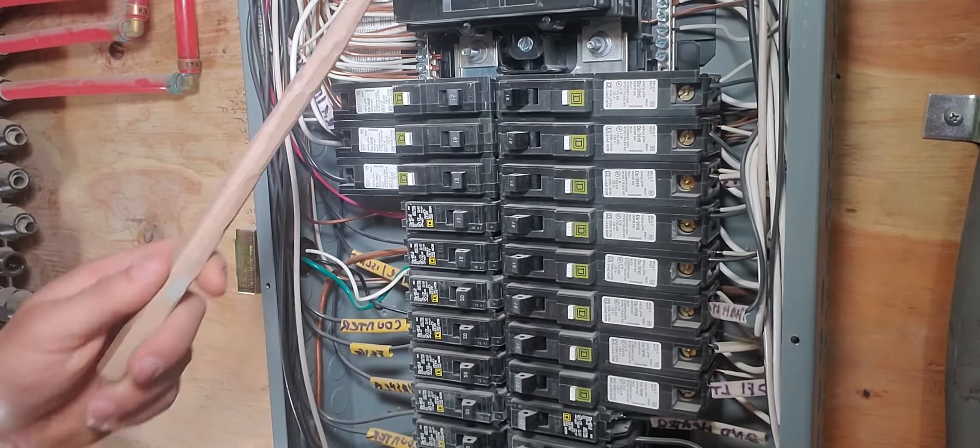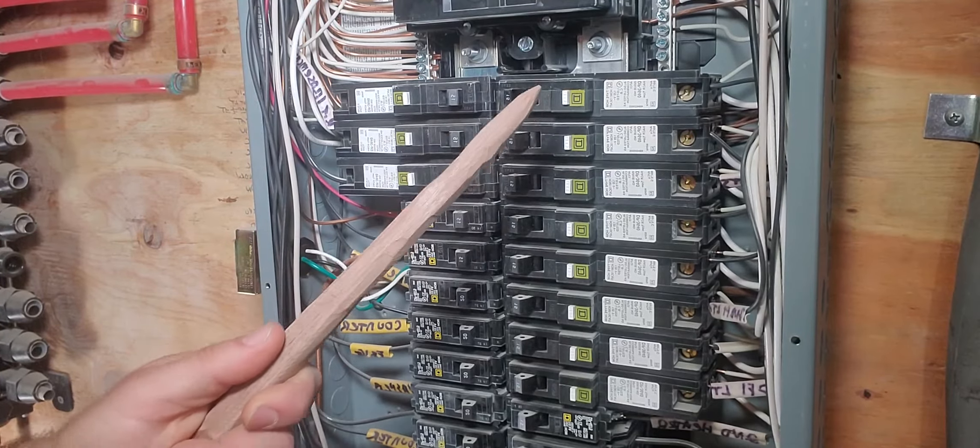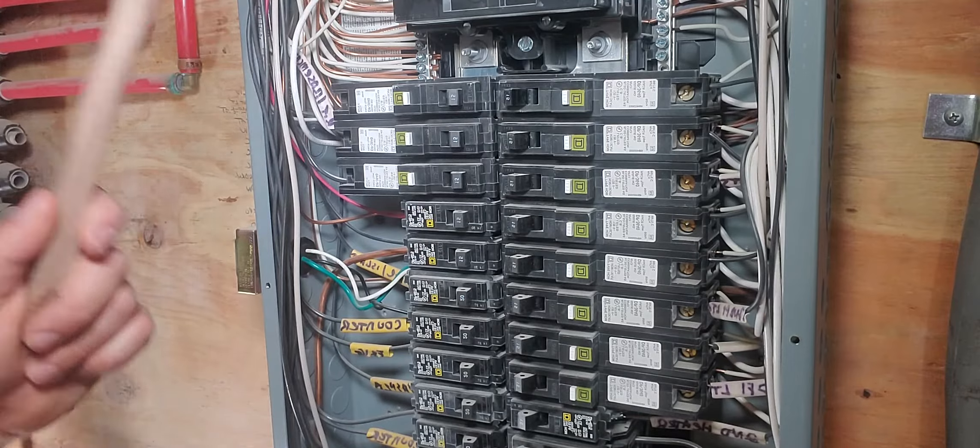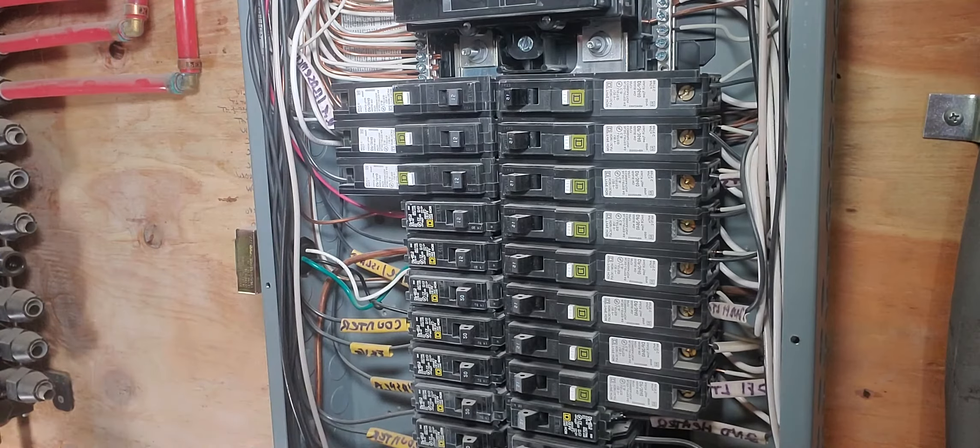The smaller breakers below the main also have numbers on them. In this case it says 15 — 15 amps is going to be allowed through the wiring associated with this breaker. Using our same example, that means we'll be allowed to use three shop vacs in this room. If you're running three shop vacs and then walk in and turn on the light — boom — it's going to turn off and protect the integrity of those wires and prevent you from doing too much cleaning.